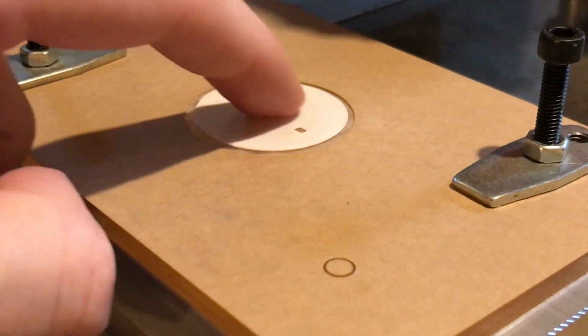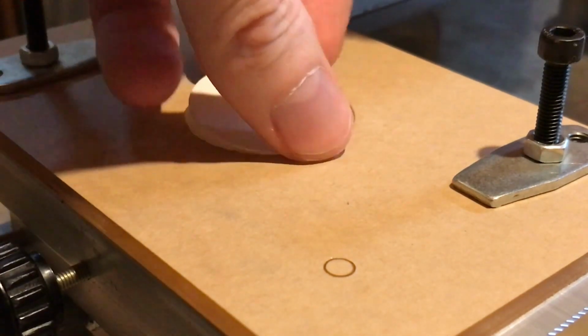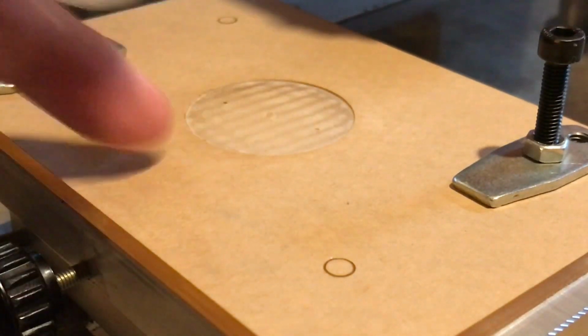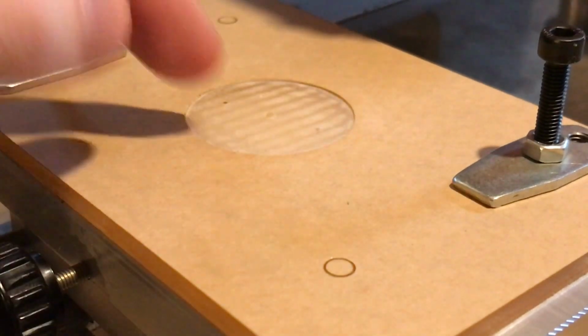So there's something in the middle that's holding this in place, a raised surface in the center hole, and then the two holes for the dial feet. So I've got three locations that are keeping this dial in place so that it doesn't move around, keeps it nice and centered. Again, to get one of these fixtures made, you'll often see them in other videos, or if you're in a professional watch manufacturing facility, these are going to be made of steel and usually circular. But for my pad printer, and for low cost, this was like $50 for me to get made, this particular fixture is cut with a laser out of acrylic, with the dial feet holes lasered out, the center hole.